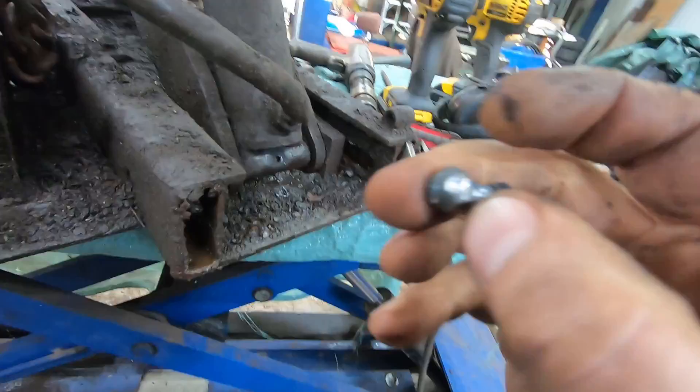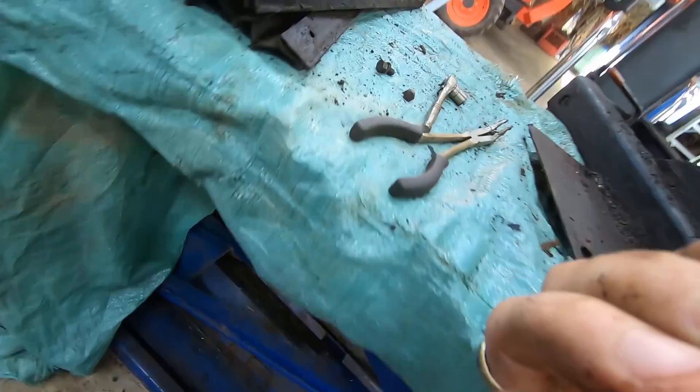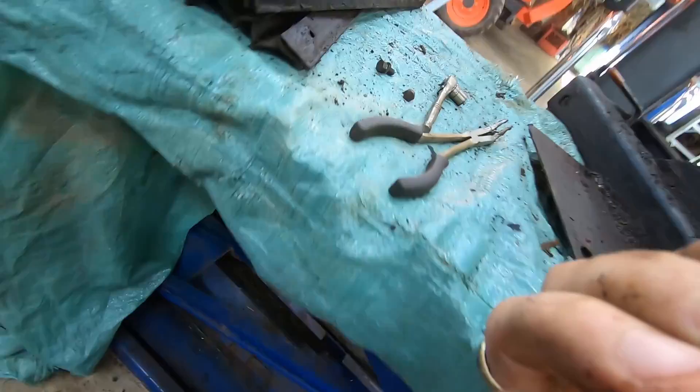I probably built that blob up bigger than the original, but there we go — that's how we extracted this broken set screw. The big blob of weld on there makes no difference, we got it out. I'll put the new one in now. I could chase the threads on this before I put it back in, but basically that pin will come out of the shaft now easy. That's how we do it — good luck with your DIY projects, and if you like my videos and they help you, please subscribe.